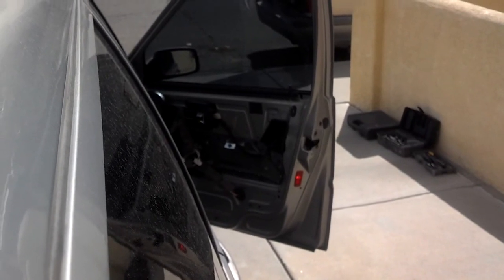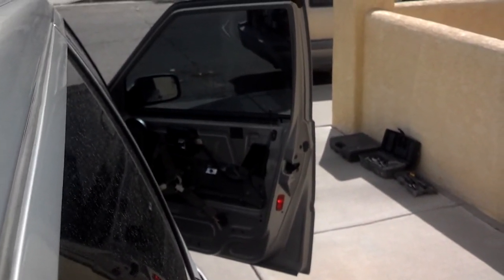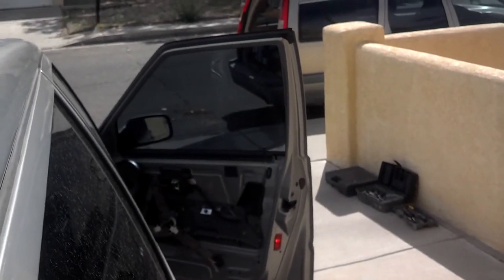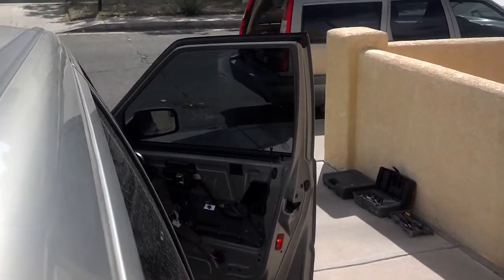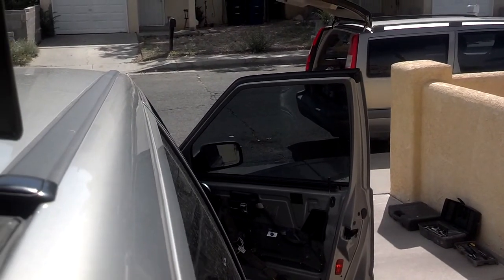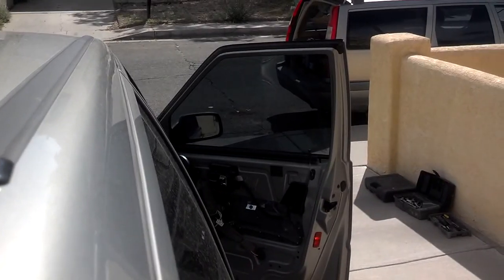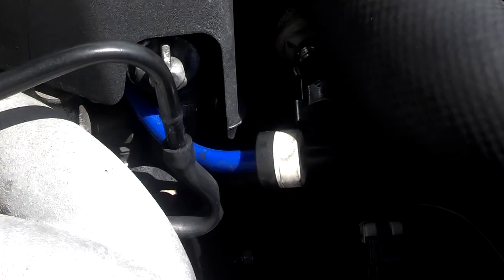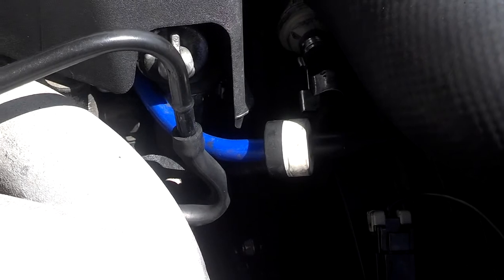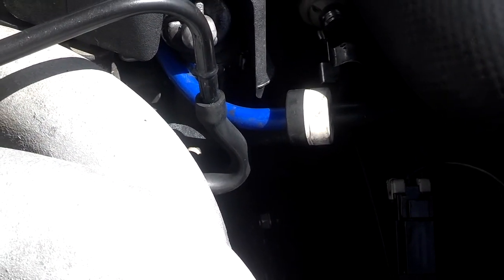So I pulled that latch open and I put a piece of aluminum in there because I couldn't find my copper. And now I'm going to put that back together, replace a vacuum line, a couple of light bulbs, load the tires from Cherry over here in the back, and give them a call, let them know it's ready. I've replaced the deteriorated vacuum line with some silicone hosing. Now I need to take these light bulbs off and test them.